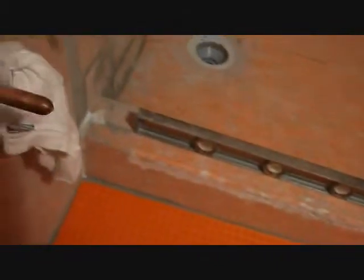Tomorrow I need to work on the Schluter KERDI wrap on the curb. Some of the wrapping on the backside has air pockets — it was very hard to do and there's an air pocket right here. I'm going to slice it, use KERDI-Fix caulk — the white stuff from a previous video — and caulk it up. Then I'll measure more KERDI fabric and rewrap it so it goes from here, up over, down, and out about three inches over the DITRA.